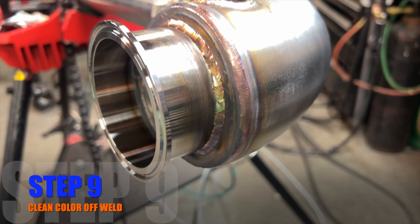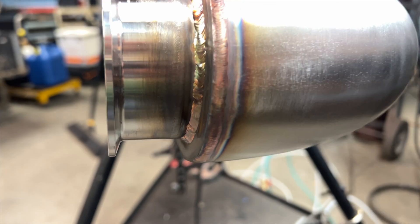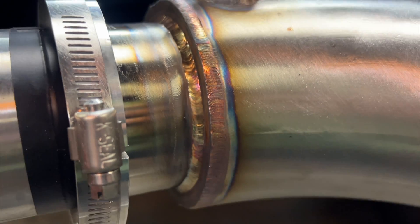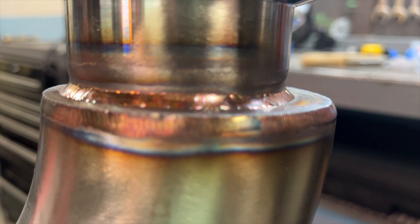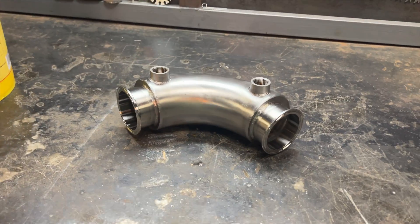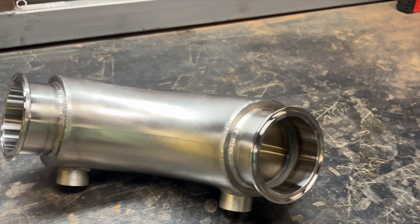Now we've got some nice consistent TIG welds that aren't too dark or charred — meaning not too hot. You definitely want to clean all the color off your stainless welds, and that's the next step. I'll link a lot of the consumables we use down below, and I've also put my storefront there so you can look at all the tools and equipment I use on a daily basis. I made a full-length video just on sanitary welding, a video dedicated to purging stainless pipes, and a few other piping videos as well. If you hated this video, be sure to not subscribe — that's the best way to let me know to stop making content. Now that she's all cleaned up, she'll get pressure tested, then washed and swabbed by QA before being installed and pushing some chocolate. Thanks for watching, see you soon.